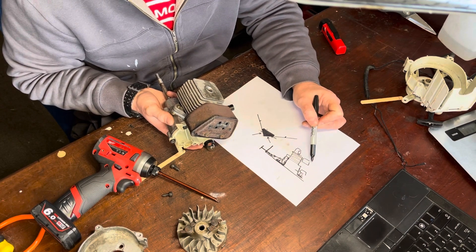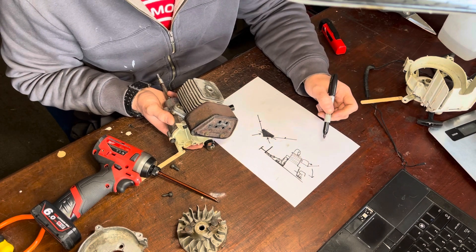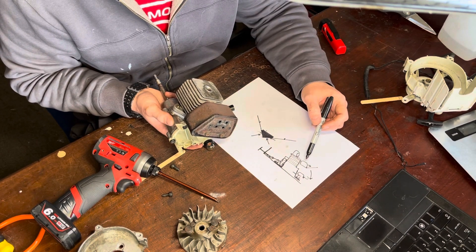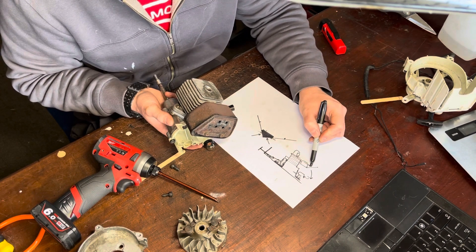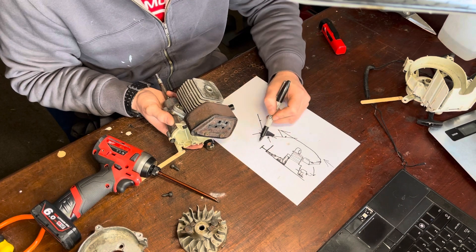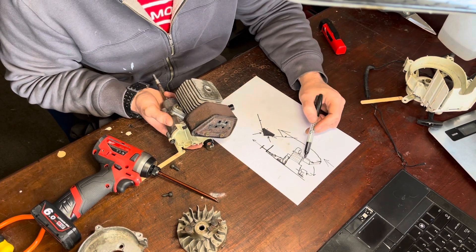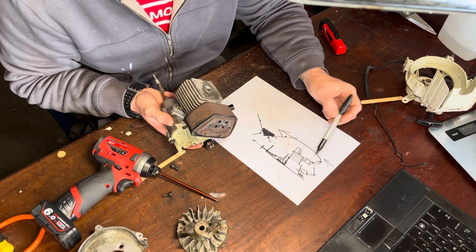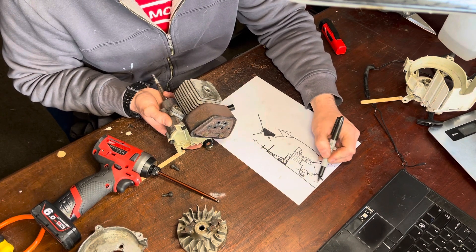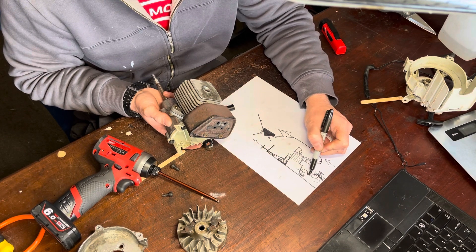I'm thinking - I haven't got a means to weld - so I might just put a deflector so the muffler gases don't go back into the hull and get recycled back into the intake. It will be taking fresh air. I'm going to put a couple of louvers in the roof of the boat, so the exhaust gases are going to come up and shoot up here, while fresh air is passing over the boat - essentially going in the same direction as the propeller. I think that's the simplest method without having to weld or cut anything off. It maintains the baffle which is good - it's going to be quiet on the water. Fresh air can come in through louvers in the roof, down into the carby. That's the plan.